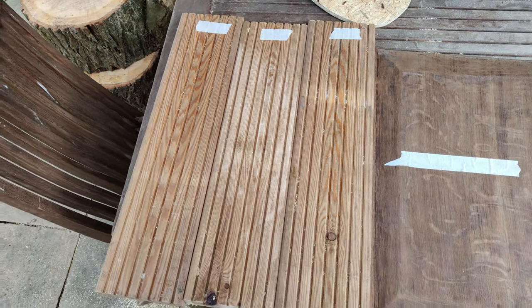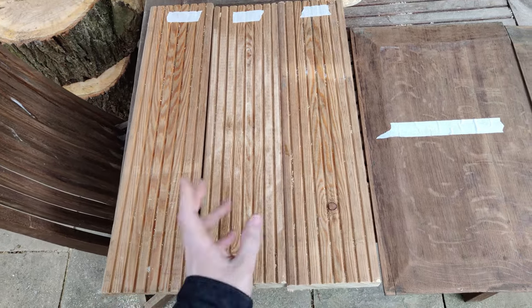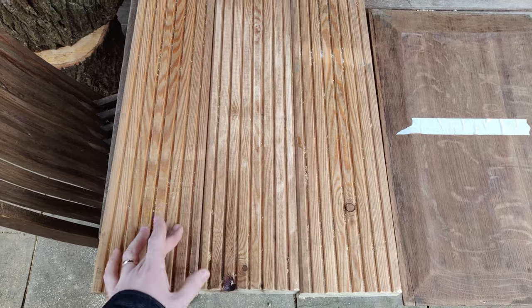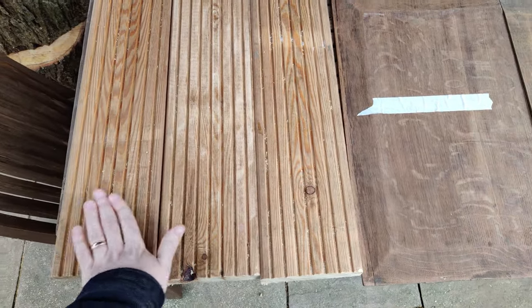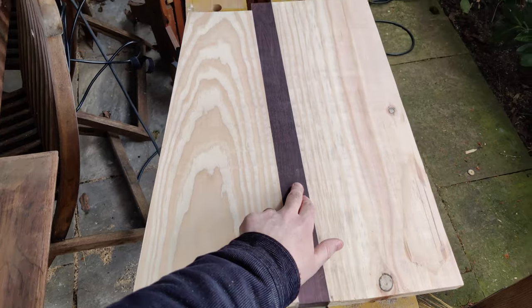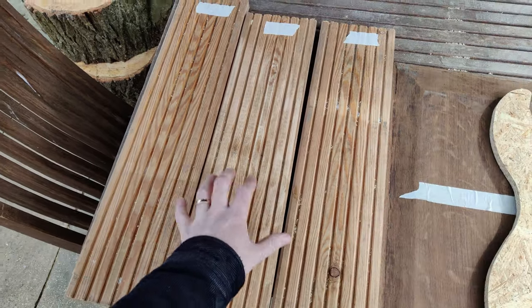I was really aiming for 35 to 40 millimeters total, so I don't want anything too thin. So I problem-solved and came up with more pine — these blanks here, all part of one really long outdoor decking board, I think a Norwegian type of pine. I've cut three of them roughly to size and flattened out the sides so they can be glued together. There are ridges on both sides, so once glued I'll use the router jig to sand them all flat. A pine guitar isn't the most desirable, but I'm going to be using a veneer on top anyway.